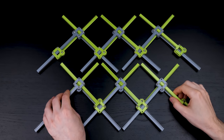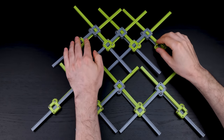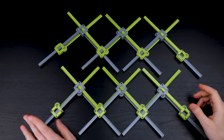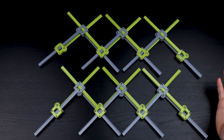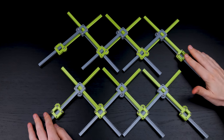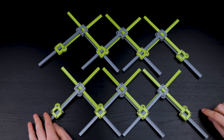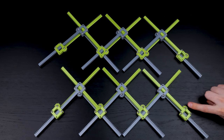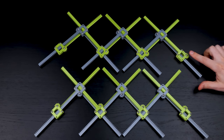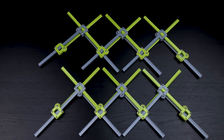Here's another mechanism that looks very similar to the expanding/contracting mechanism we've been looking at, but does something completely different. Spot the difference: the gear wheels on this new mechanism are all pointing in towards the middle of the chain, whereas on the old one they point backwards or forwards along the chain. There are also differences in the racks to mesh with the gear teeth accordingly.